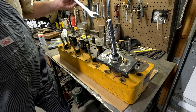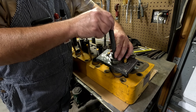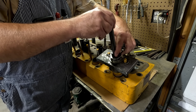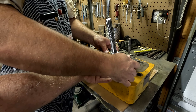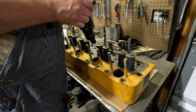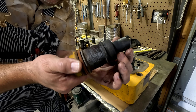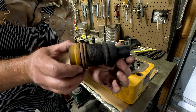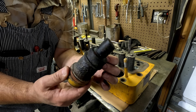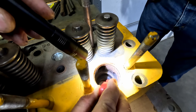My guess is that when they put this newer head on, they probably put in new pre-combustion chambers. McCoy Caterpillar did that in Durango — it was rebuilt and redone. You know what, you look pretty good. Maybe they did it when they overhauled it. It's rust-pitted to be sure, but it really doesn't look terrible. It's not all built up and corroded and plugged up in the holes that cool it. Ours was terrible.